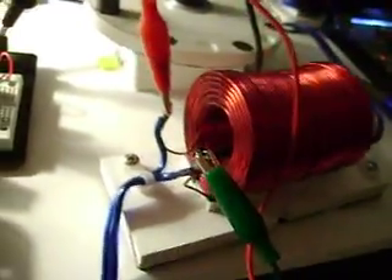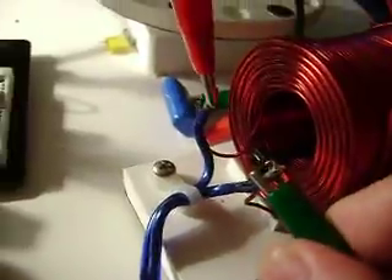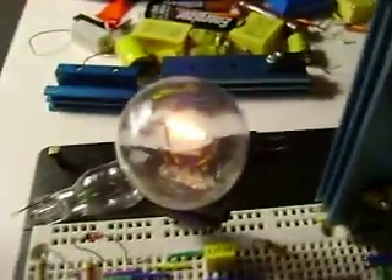Let's put this cap back in. It's just going across these rails here. And now we have this one. I have a little broken ferrite bead there that I'll pull out. I got these leads on here with a cap. It just helps to tune this. I've been experimenting with different caps so far. This one is the one. Let's see if I disconnect it — you can see the difference with it on and with it off. So that helps. We're picking up off of this one to this one to light this bulb, and we're taking the back EMF from over there.